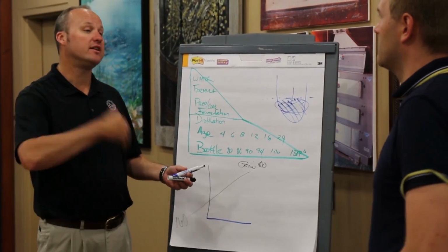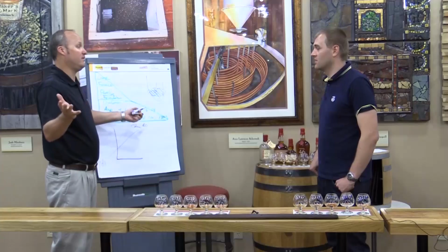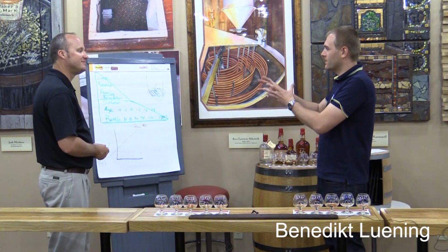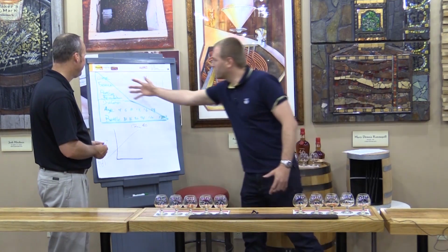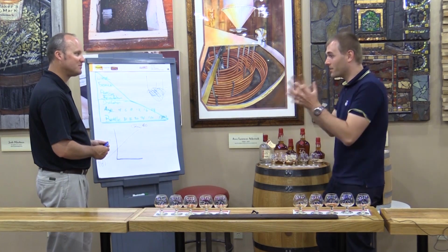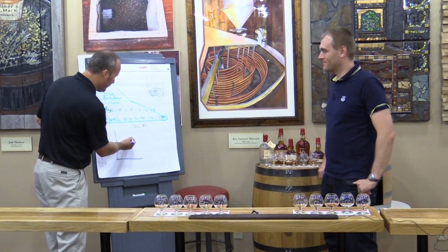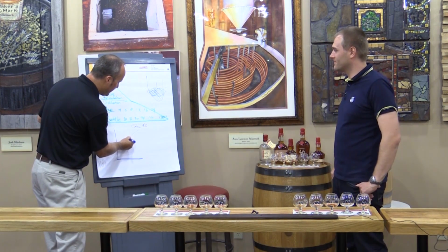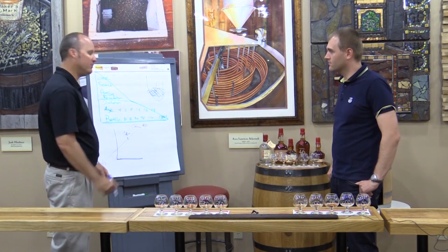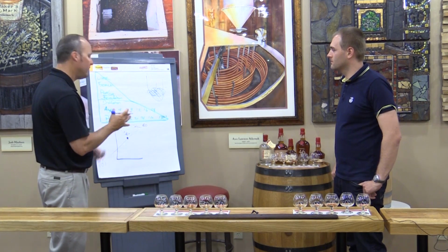So think of it like this. Vodka is distilled at 190 proof, 192 proof. There's no flavor. Yeah. So what I was seeing in the distillery is that you're looking at all of your quality, you get the flavors right, and then you don't want to distill them out because you already worked so hard in getting them. Exactly. So we're going to be right in here, somewhere. Remember, we're at 130 proof off the doubler. So we know that we're going to get this great flavor profile there.